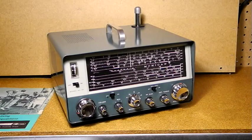In summary, the major strengths of the Mohican are portable operation — where portable really means you can lug it to the cottage and run it on batteries. It's self-contained with a built-in speaker and antenna. It provided general coverage of shortwave and band spread for ham bands. Realistically, this could be used as a backup receiver, but probably not as the primary one for a serious ham radio operator. It receives AM broadcast bands and has pretty good sensitivity, with support for receiving CW or Morse code and single sideband signals.